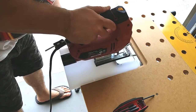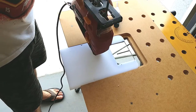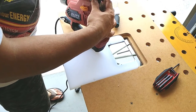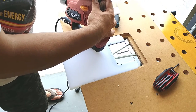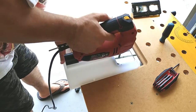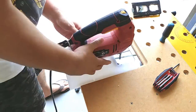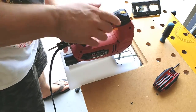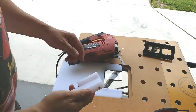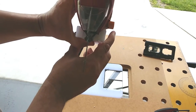With the clear window mounted, it is time to install the jigsaw. However, after some consideration, I opted against using the OEM base. Instead, I have decided to build one out of polypropylene scraps. That also means that I will be giving up the angle cutting feature of the jigsaw. Although it looks taller, a single piece of half-inch will do the trick. But I am concerned about lateral movement when under load, so I have decided to add two lateral boundaries to make sure the jigsaw has no side-to-side movement.